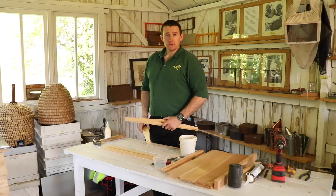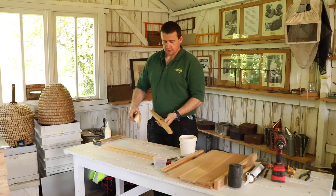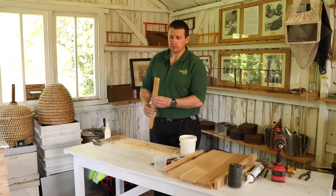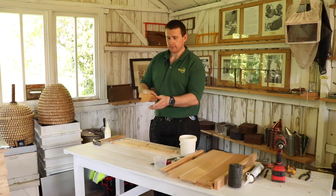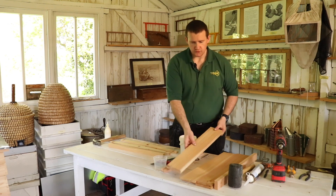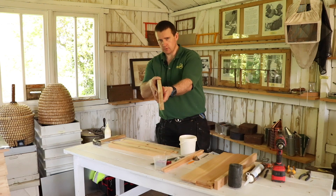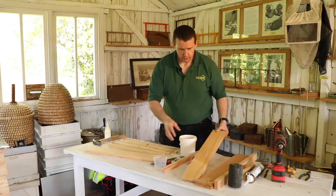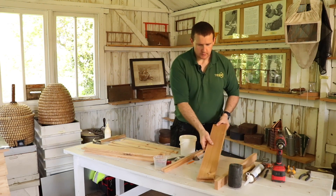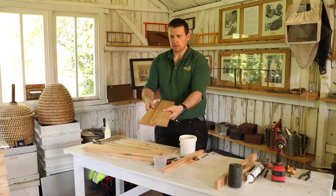Hello, my name is Rob. I'm going to show you how to do a WBC roof — how to put it together. We'll start by going through the components. You'll have two gable ends and two sides, both of which will have beveled sides on them, so they're easy to tell — a bevel like that. The roof sections come in three parts: two again with a bevel on, which are the top section, then a middle section which is basically two planks of wood with square edges.